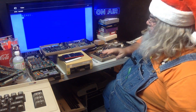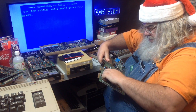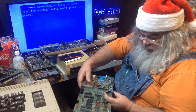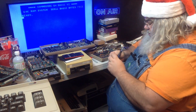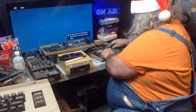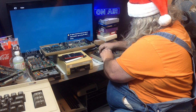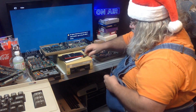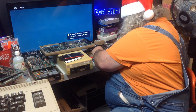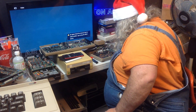Alright, turn that back on. While that's coming back up, I'll yank out the third one. This one is a 901-226. So we're still going okay. Always a good time to find spare chips. And of course I'm using my screwdriver, not a chip puller. Alright, very gently, always checking the witness mark. Turn it on.